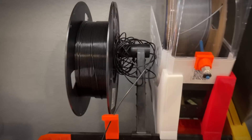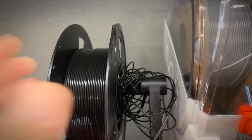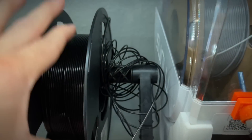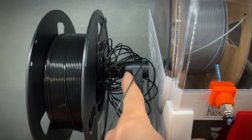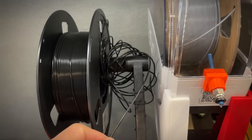Here's the problem when not using a filament guide, even one that's a little lower: if you have a full spool — and this was just a demonstration of what happens — it pops off over the edge of the spool and can get tangled like this. And when your extruder's trying to pull it, it can't, and you've got a failed print.